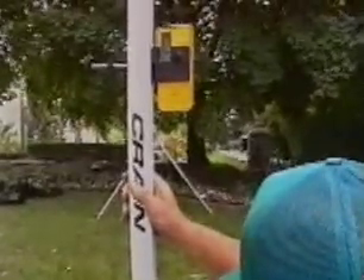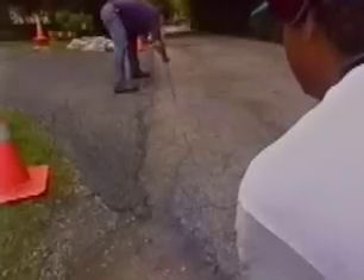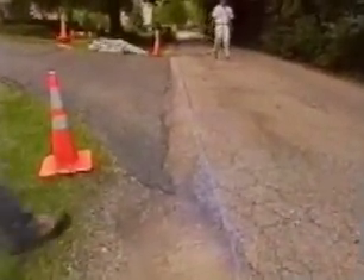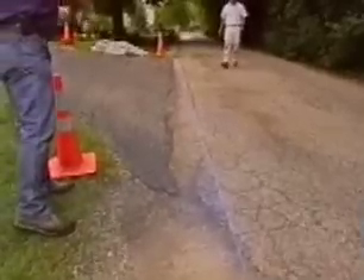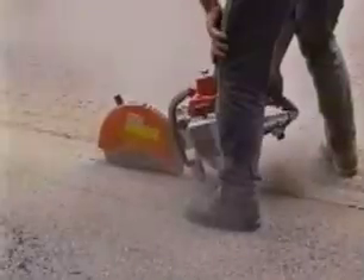You can determine the grade by measuring with an optical transit or laser level. Where the driveway meets the street, draw a straight line at the edge or a couple of inches into the street. Then measure down the straight edges of the driveway and figure the curves at the end to mark the endpoints of this line. Then saw along the line. Make sure you don't over-cut this line — the city won't be too happy about it and it could cost the company money.